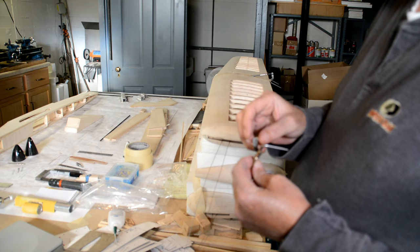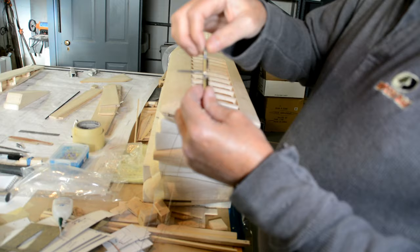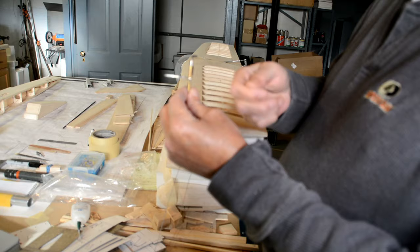And I took these and cut these out, filed them down, ground them down by hand, drilled the holes, and put them in the jig. And he has a little thing where you make a little donut out of this silver solder. You slide it over that wire, and you're holding this wire up straight. And slide that little donut on there, and you put a bunch of flux on it. And you hit it with a propane torch. And just wait, wait, wait, and all of a sudden it'll just liquefy and go poof.